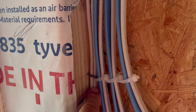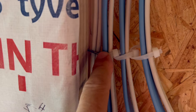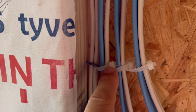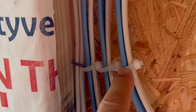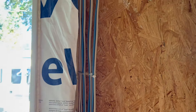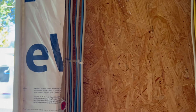If you're going to end up with more than three wires under a staple, you can put two under and then use some zip ties off that first staple, then put two more with zip ties, like this. The idea is you want to keep these wires in the wall long enough so they don't hit the drywall or get pinched. It takes a little more time doing it nice and neat, but it sure pays off.